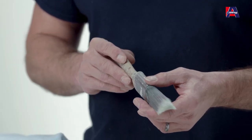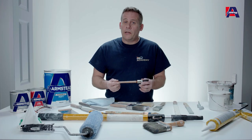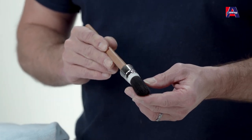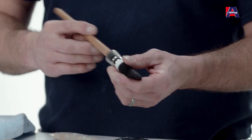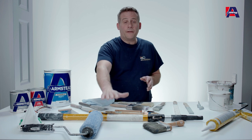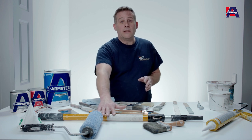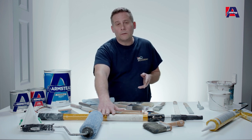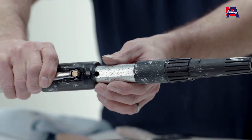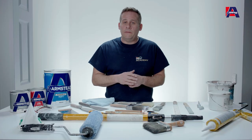If you're going to be painting windows, a set of sash brushes are really useful because they're designed for painting sashes on windows — perfect for cutting in really quickly. If you're painting ceilings and walls, it's always best and faster to use an extendable roller pole. It can be attached to virtually any roller, allowing you to reach over furniture, and it's actually faster even when applying paint to the walls themselves.